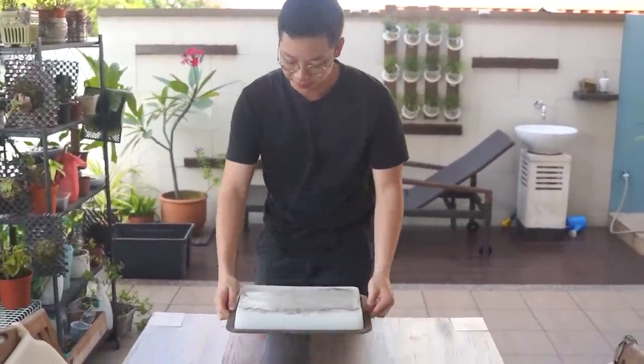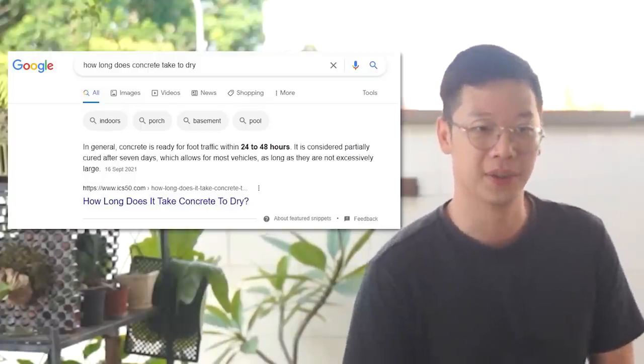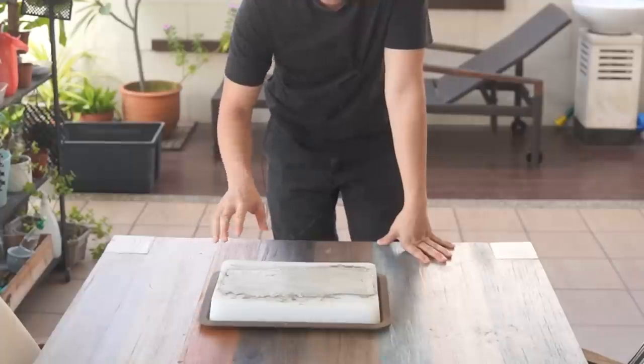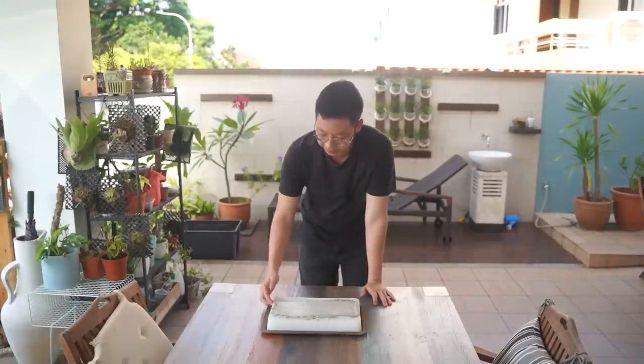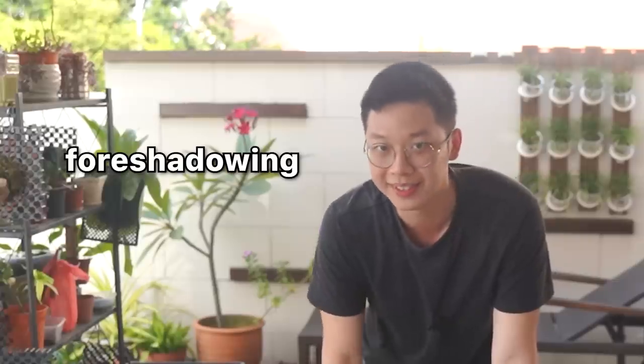It's actually been a week since I made the pour — finally dried. It actually takes about 24 to 48 hours for concrete to dry, but it cures within seven days. So it's been seven days. I'm kind of scared to open it because it's been kind of brittle at the sides. The worst thing that could happen is probably the thing cracking in half, but let's hope it doesn't.